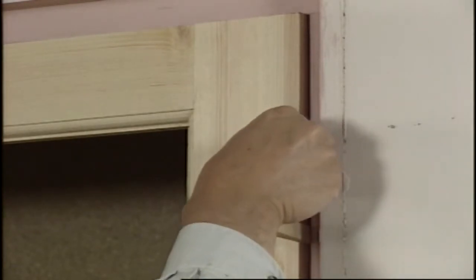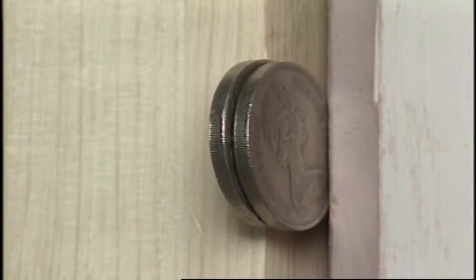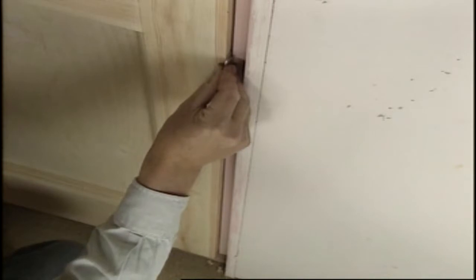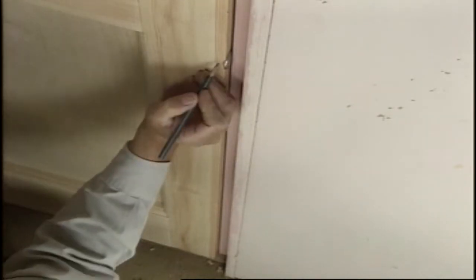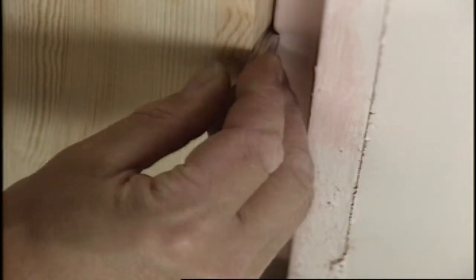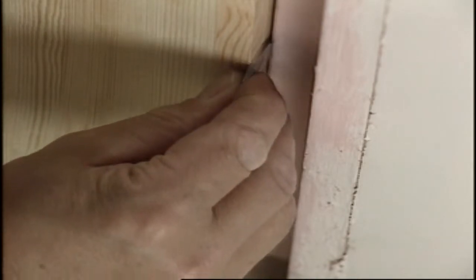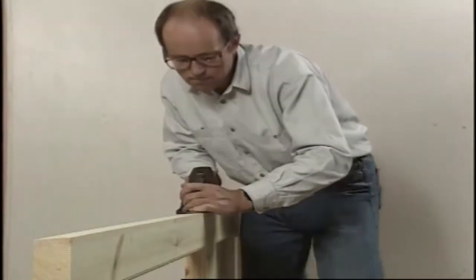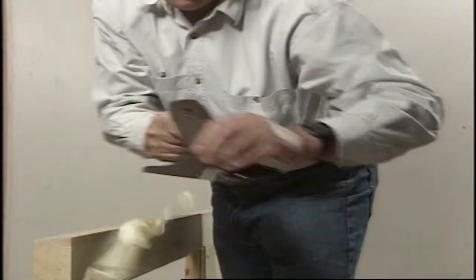Wedge the door hard over to the hanging side. Using two 10p pieces as a guide, check whether the closing side has an even gap. Mark the areas that need to be eased. Again, plane a slight bevel to prevent binding.